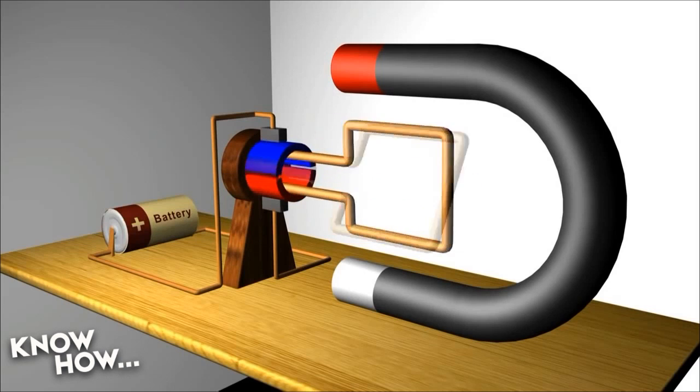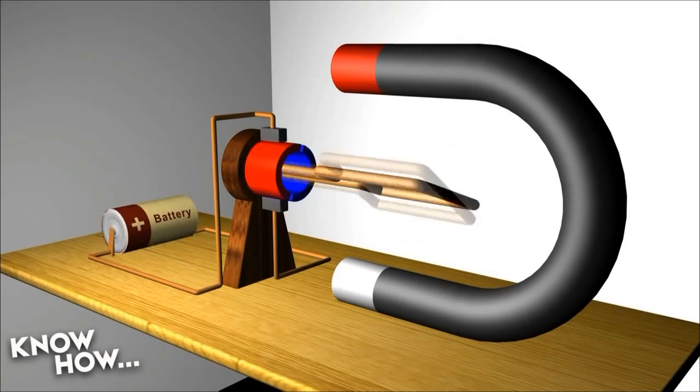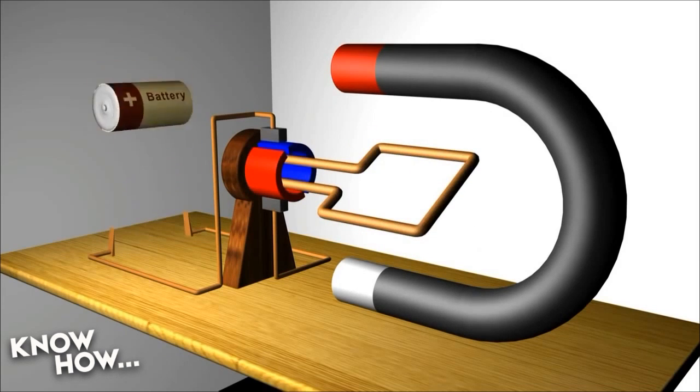We want constant motion, constant movement, constant power out of our motors. All electric motors depend on one important thing — the secret is the commutator. In a brushed motor, the commutator is the part of the armature connected to the coil, and it makes the electromagnetic field that connects to the brushes on the assembly. The commutator has two jobs. The first is to transfer power from a fixed point to the armature. Because you've got a rotating assembly, you can't just have a wire bringing current into the coil — eventually the wire would run out of length, spool around itself, and break. So this allows you to have a fixed point, those two brushes, transferring current into the coil through the commutator.